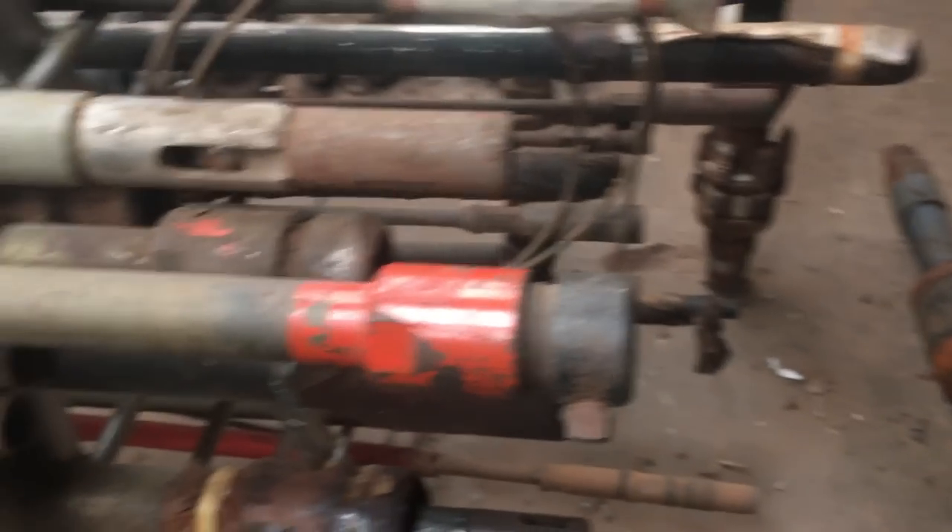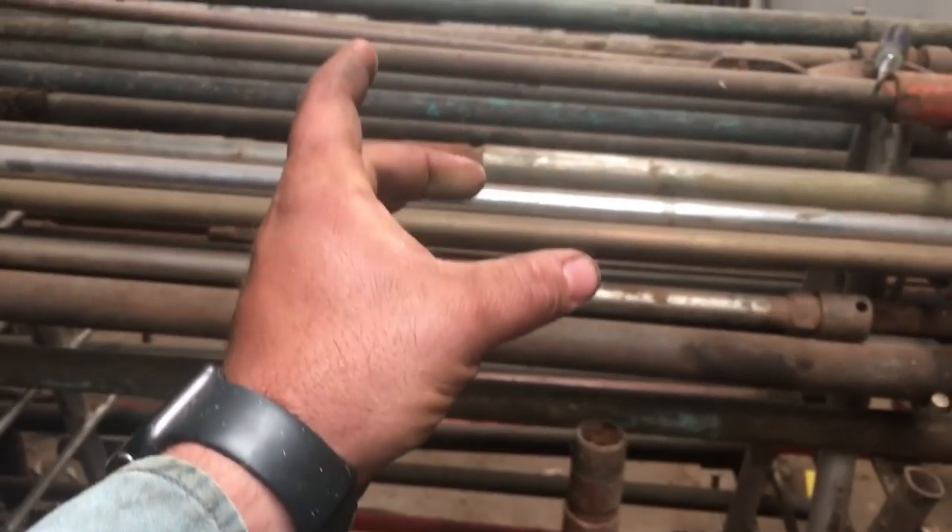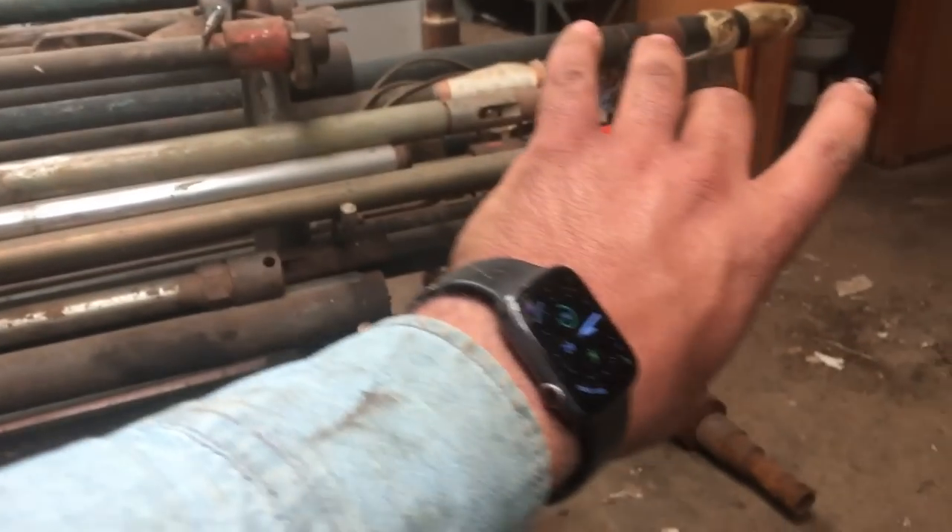When the plunger is picked up again, it takes another stroke. What's going on is this barrel is worn, and whenever the plunger is picked up there's a significant amount of fluid slippage that just goes past the plunger. What we're going to do is measure the efficiency of the pump.